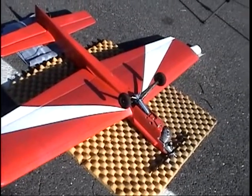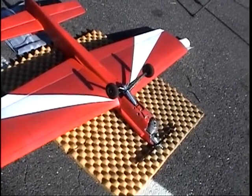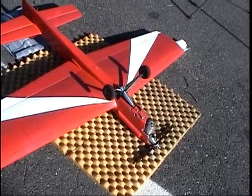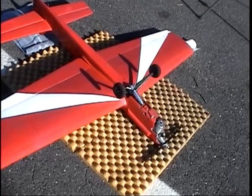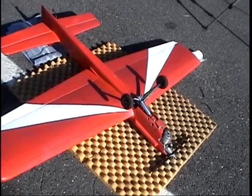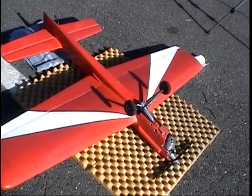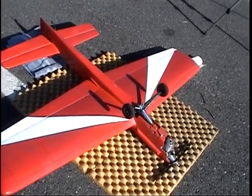What I wanted to do is get the motor running right where I was happy with the characteristics and everything, and then just start swapping props on until I find the best prop. But for right now, I just need to get the motor, and I got the tank shim very close now. We're probably within a 64th of an inch. It was 2.4 both ways, and it's got that nice speed control when the wind starts blowing. Normally an engine wants to just blast off, this has a little bit of a governor, and I don't know why yet. Probably the exhaust timing is part of it, and part of these muffling systems and props is the other part. But we're learning a little bit every flight.